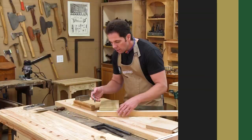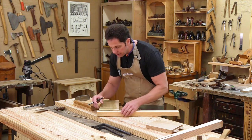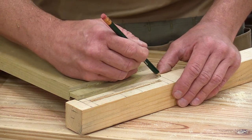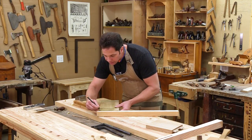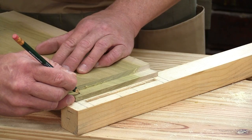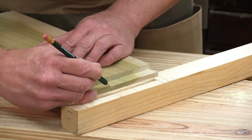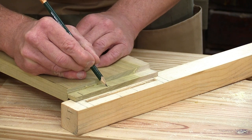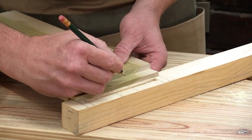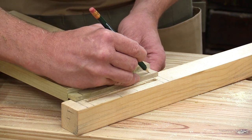I have one edge that's starting to go in nicely, and the other side could take a little bit more. Here's how I transfer those marks off of my leg onto the apron board for the tenons. I have the apron positioned at the top and at the bottom, and I'm going to transfer the marks for where the mortise is up to the tenon. I'll keep the top one in line with it, but when I come down to the bottom one I'll actually make the tenon a little smaller, giving it some room to expand downward. I'll also mark this at the top and cut that one a little short as well.